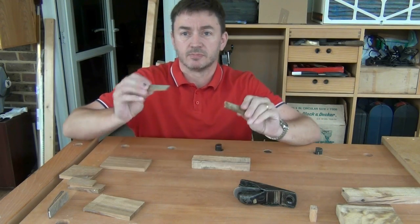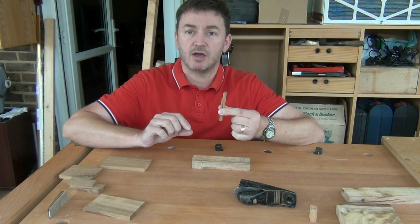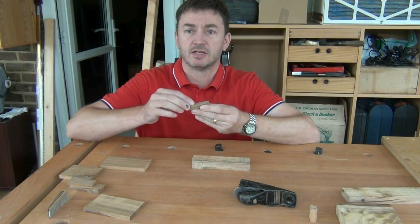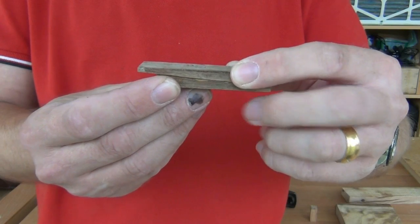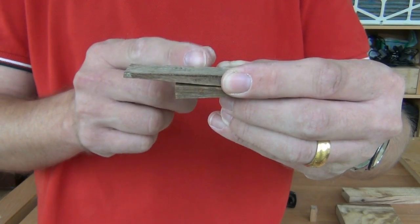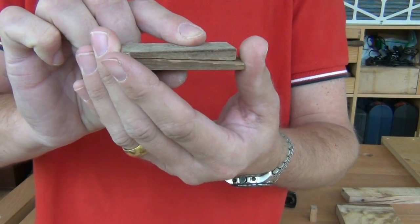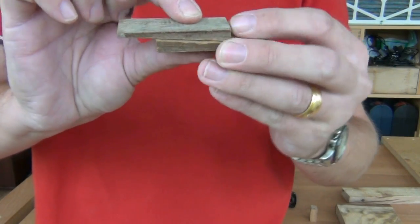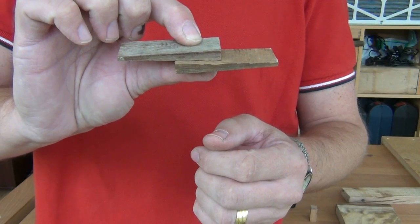You can use wedges — a pair of folding wedges, also known as sliding wedges, put together. When they pass by each other they increase in total width. As we push these wedges against each other, hopefully you can see that the distance between them gets wider and wider. It narrows when we part them and widens when we push them together. That's what we use to wedge our work between bench dogs.